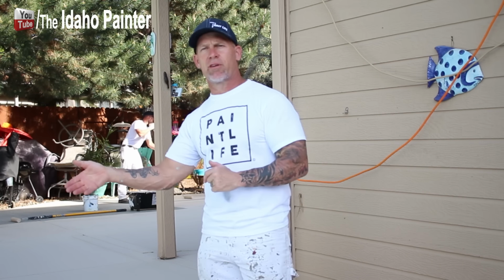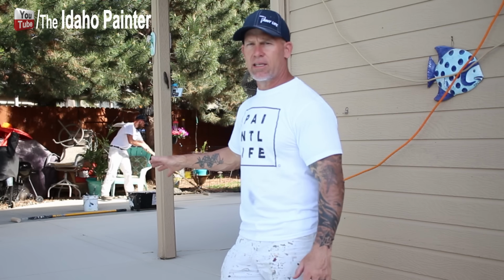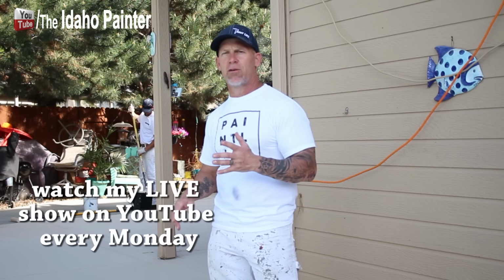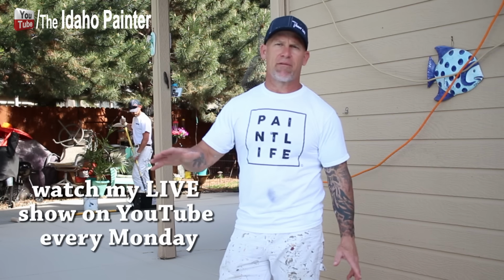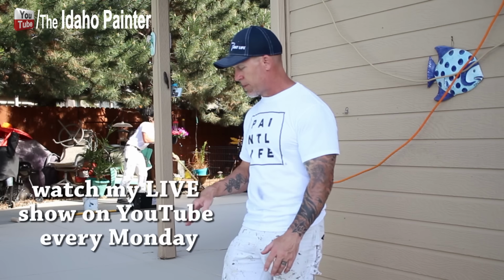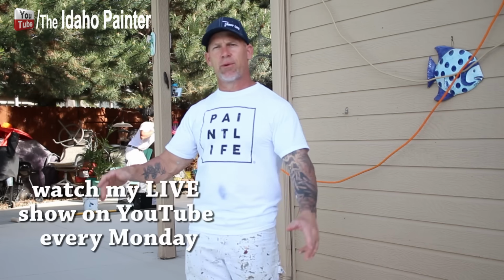But we're going to test the temperature with our laser thermometer. If it's too hot, we're just going to wet it before we roll it out up there. But it's cruising right along, rolling. I like it because it's drying really fast, so we'll be able to do two coats today. It does state that for heavy traffic, you don't want to have heavy traffic on this for, I think, 36 to 72 hours. I think it's 42 to 76 hours. You have to read the instructions, but we're just cruising right along, getting it done. We'll show you what it looks like when it's all done.